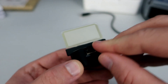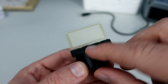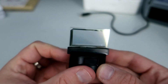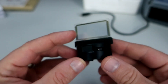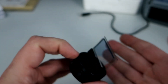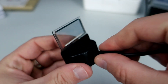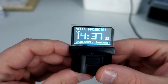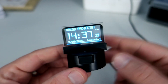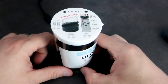Here is also this Grove port for external modules. Many manufacturers are now including these Grove ports on their devices — it is an easy and simple way to connect something to the device. Here is the USB-C port for programming. Arduino IDE is currently the best way to program this device. Installation is simple and very well explained on the LilyGo Studio web page. Also on GitHub you can find many examples to learn from.